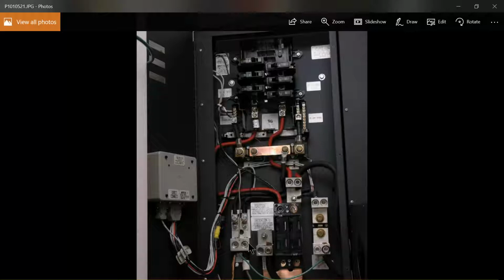It goes to this terminal block that has a couple of connections on it, and one of those connections goes up to this bus bar that has a shunt for both the negative of the PV current coming in from the array and a shunt here that is the negative for the DC loads. And I don't see any DC loads connected, so we could just make that a moot point in this particular operation, but I'll discuss it to some extent.